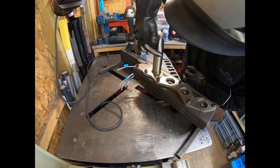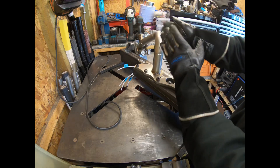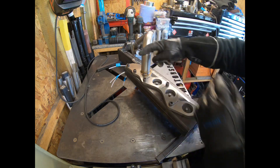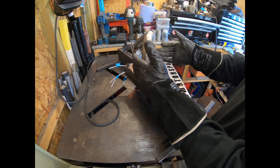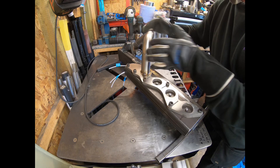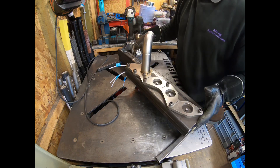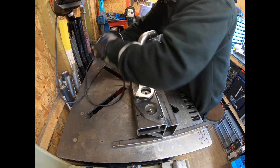I'm now going to weld up this header here on this side, because I don't want this tube tilting inwards as I weld all the way around. It had a bit of lean on it anyway, just how I made it — that's how it was. So I'm going to weld the outsides of this one and this one to just try and pull it back over a little bit to make sure it doesn't lean right in, as that may end up hindering one of the other tubes.